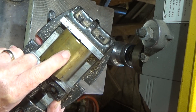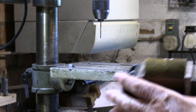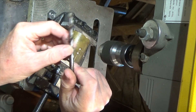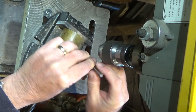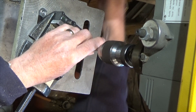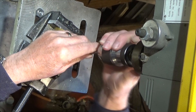I've made these holes a little more pronounced, because the real drill hole size is larger. If I were just to go in as-is, this drill would not be able to centre properly — there's a good chance it would dance around. This is just to ensure the flutes of the drill pick up on the sites we've marked out.